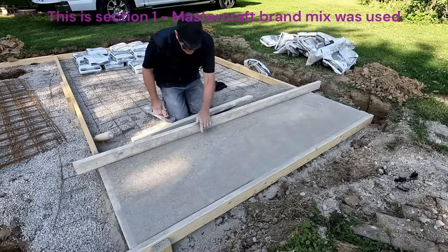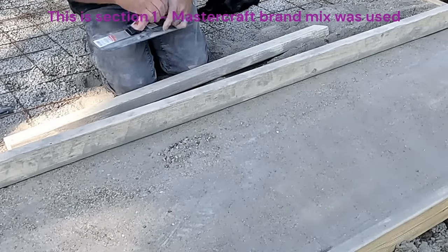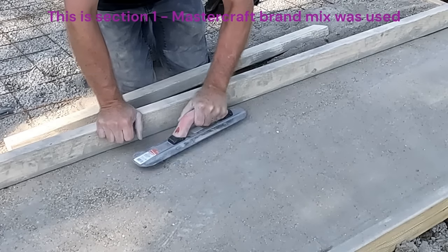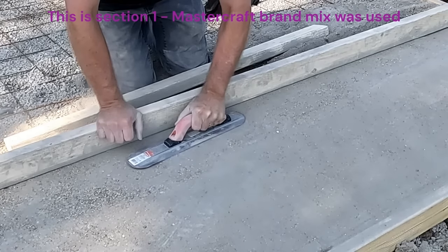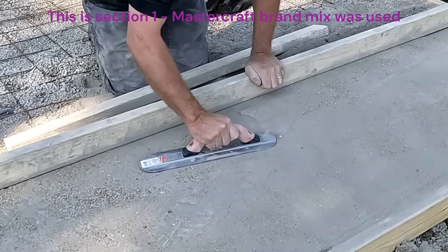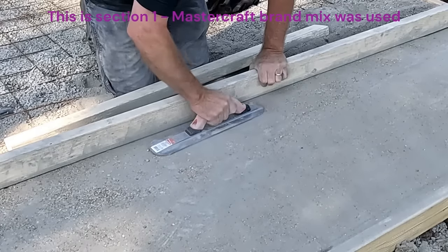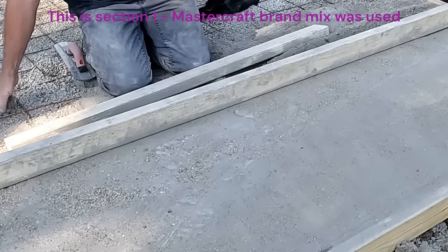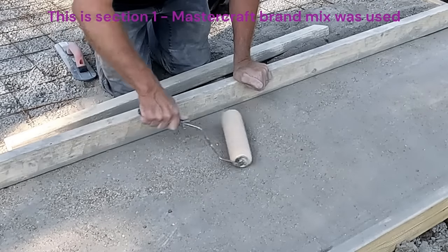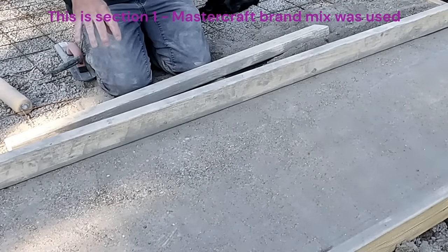What I did discover: if I leave these little low parts with exposed aggregate pits, I can use the mag float and just kind of pound some extra concrete in there, then blend it out. That's a little easier to do a touch-up spot like that, and then after I get that touched up the way I like it, go ahead and run the paint roller over it to blend it all in. That is proving to be easier than trying to get it screeded perfectly.